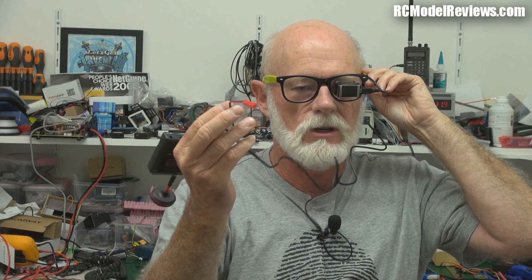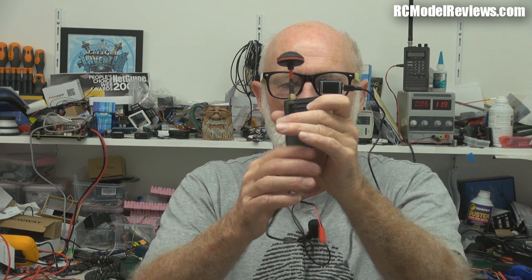I'm probably going to cable-tie the lead up to the edge of the glasses, which will help a little bit. It's also too short — I guess you'd have to nail it to the velcro on the other side of your head. I'll have to extend this lead, as it will go off to my battery. I'll probably run the receiver and the eyepiece from the same battery — a three-cell with a BEC. That means just one battery, probably taped to the side of my head, with the receiver velcro'd to the side.